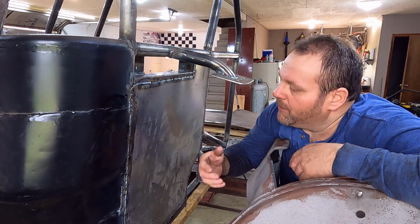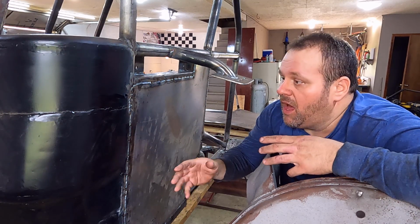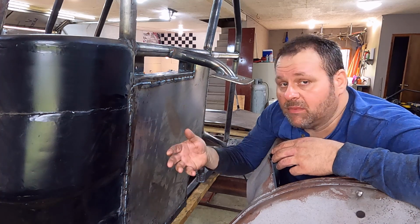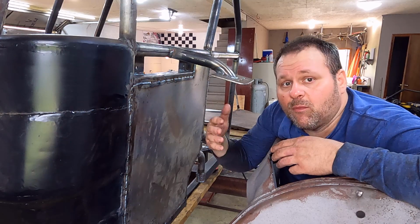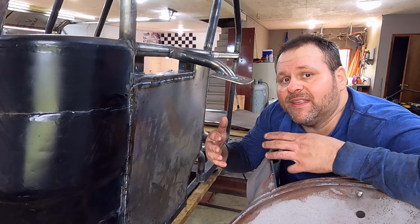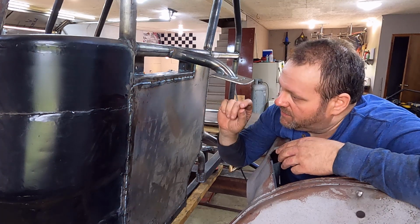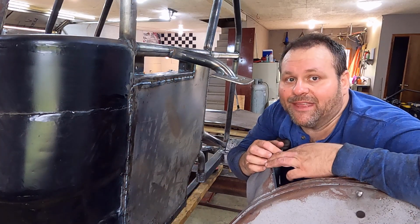But I caution you here, as a rule, I don't like cleaning welds up unless there is a reason for it. And that's because if the car ever changes hands and someone else is involved and they don't know who built the car, if they're seeing where these welds have been ground down, now they're questioning the integrity and your competence, and they don't know exactly what you were doing there. So as a rule, building, don't grind welds down unless it's a very specific reason for it, like right here down this line. So that's my take on it.